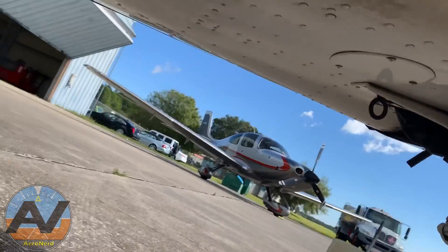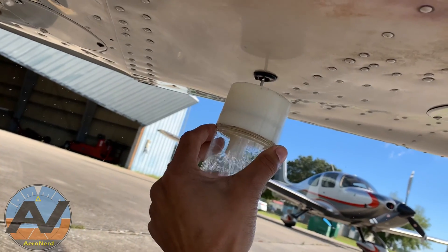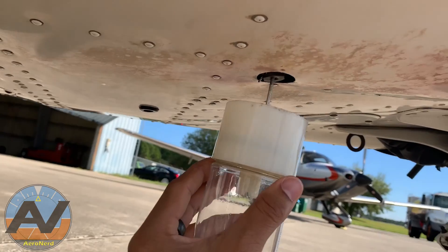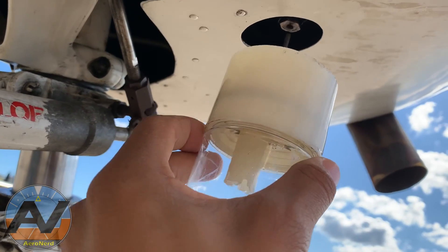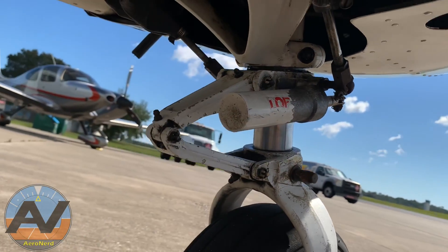The great thing about the Gats jar is that if there is water, you can pour the gas out through this filter. These little screens only let fuel molecules through and not water molecules, so you can put water-contaminated fuel in and dump it back into the tank — only the fuel will come out, and the water stays inside. Underneath the aircraft, the first sump is your strainer for your fuel selector, the next is the drain for your reservoir tank, and the very bottom of the engine is the last one.